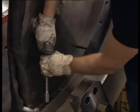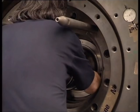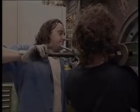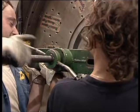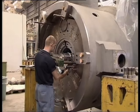After the head covers have been tightened, the end labyrinth seals are fitted. Both seals are lodged in the head covers. The labyrinth seals are fixed by a Seeger ring. Before starting to install the gas seals, it is essential to check that the rotor is in the center of the diaphragm bundle and to lock it in that position.